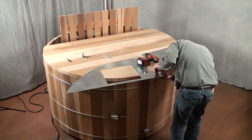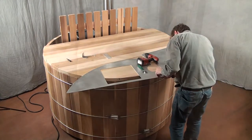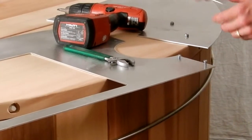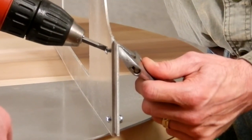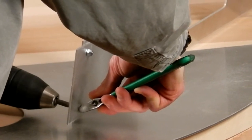Your aluminum cover will be a quick and easy assembly. Your mounting brackets will be bolted to the large section based on the position in which your stove is mounted. Using the provided nuts and bolts from the aluminum cover mounting pack, secure both metal plates to the larger of the two cover sections. These should be bolted together tightly to ensure that the smaller cover section is secure once it's in position over the stove.